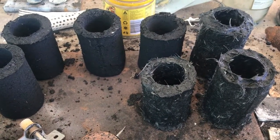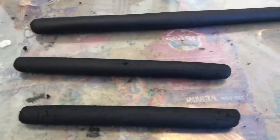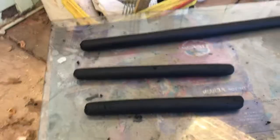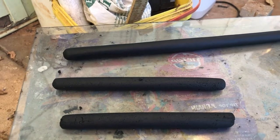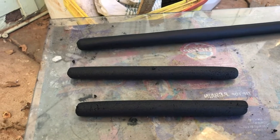Okay, today I made the negative electrodes. These ones have zinc sulfate, so I started off with 200 mils of distilled water. I put 20 grams of zinc sulfate, dissolved all of that, then I used 6 tablespoons of cornstarch or corn flour and brought that up to temperature to about 76 degrees.